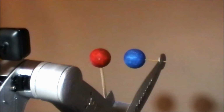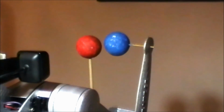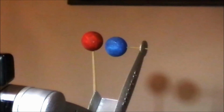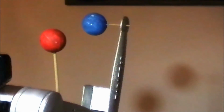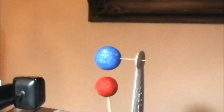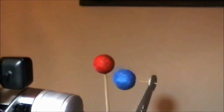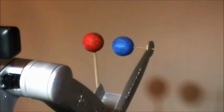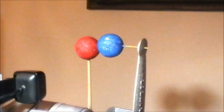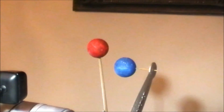The first test consisted in tracking the red reference object by the blue handle located at the end of the arm. This was done slowly, moving the first manually. It was demonstrated the arm slowly followed the object, matching them with an error virtually 0. Only for short periods of time was it observed that the camera did not visualize the colors, but as fast as they were found again, the control action is resumed and the error produced was corrected. In this test, complete system stability is observed. The arm never moves indiscriminately, even when the respective objects were not observed.